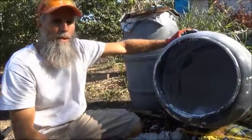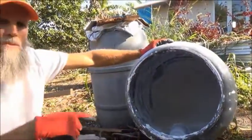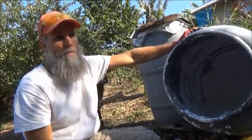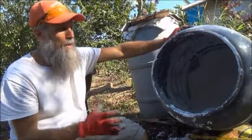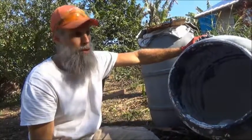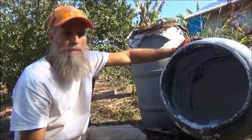This is the hydrated lime. On this project we purchased 10 bags of dry powder hydrated lime and used three different 55-gallon barrels to mix it up into a putty consistency with water using a mixer — and I did that at the start of the project, which was now two and a half years ago. They say hydrated lime only requires a few days to soak and mix with water. The original product was quick lime, which is a lot more chemically reactive and not really available to the public. In that case they used to soak it — called slaking — for years, and the longer it soaks the stronger it becomes. So that's kind of what we did here inadvertently for two and a half years. This is the main ingredient in our plaster: hydrated lime mixed with water into a consistency like cream cheese.